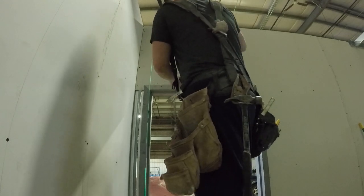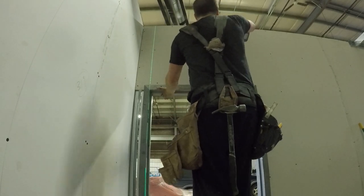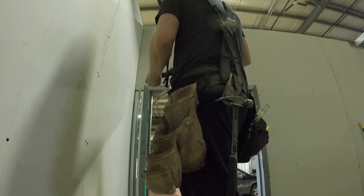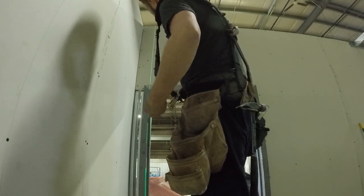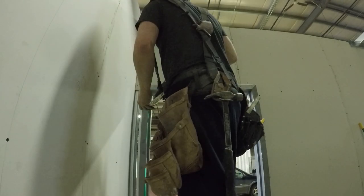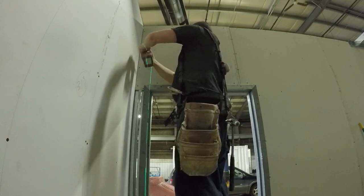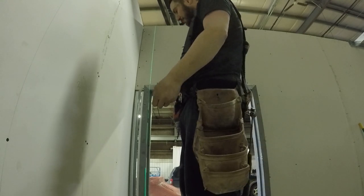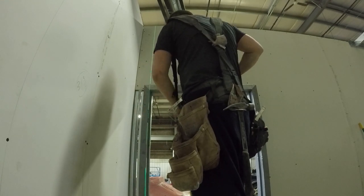I didn't cut this short because I wanted to show you how many screws go into these pieces. You'll see how I'm screwing in the door stud all the way up as well. You want to do that because it makes it so much stronger when you screw it all up properly. You always hit the header track. Get your screws in that door stud — that's actually the door stud there, and the one on the inside was a center 16. Make sure you screw it up good and screw the whole piece off so you don't have to get back up on the ladder. I'm backboarding and I'm screwing in the header and the door studs, but I have the laser on the hinge side the whole time, so I know I'm good.